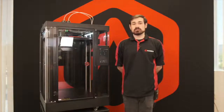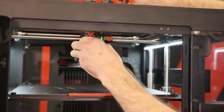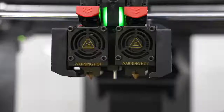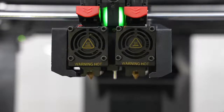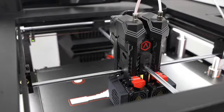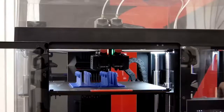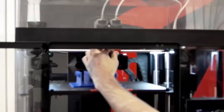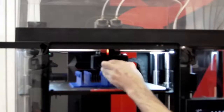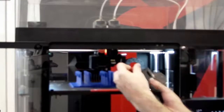Starting with the features of the Pro 3, it has new interchangeable hotends, a significant upgrade over the Pro 2's previous print head. The Pro 3 runs an independent module extruder with a dual extrusion structure, which allows it to print using a variety of filaments while reducing clogging and enabling convenient disassembly and replacement of components, reducing machine downtime. The interchangeable hotend system is ideal for users who need to switch between non-abrasive and abrasive materials or who want to print at higher speeds with different nozzle sizes.